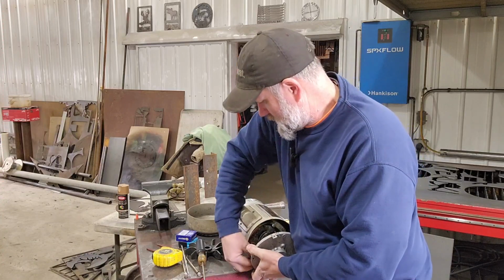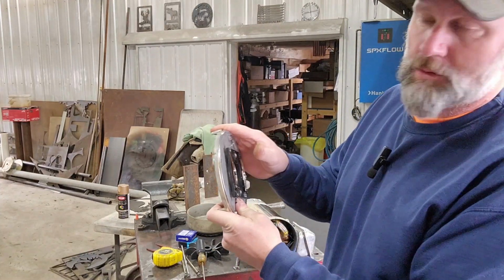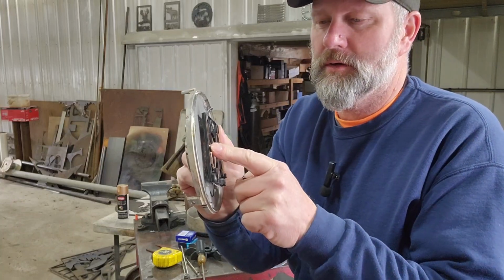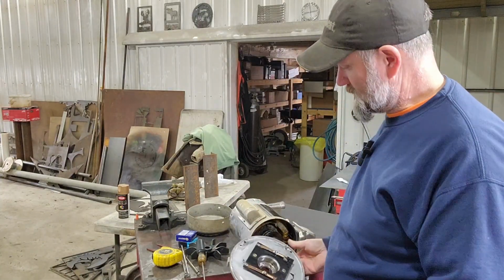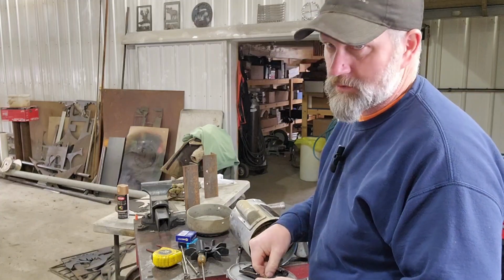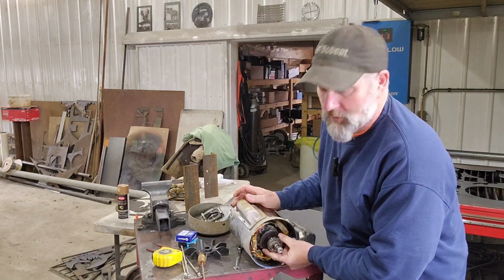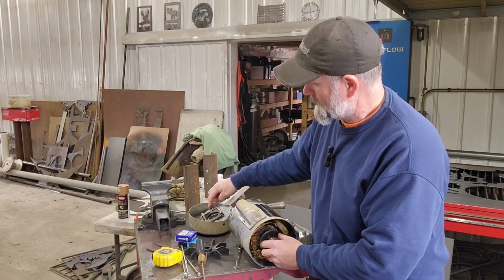So you have to kind of be careful because there's a couple of wires in there that go on this start switch, which when the motor's sitting there doing nothing, it's just a couple of points. I don't know if you can see that or not, but when it's sitting there not running, these points are together and creating a circuit for the start components, which I guess this is one of the start components. But then the other thing is the capacitor, which is kind of a jump starter, you might say. Kind of gets the thing rolling, and then once everything gets to rolling, well, then this centrifugal switch, it's called, clicks out or clicks back. The centrifugal force lets this little plate go back, which then the points aren't touching anymore.